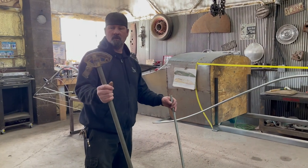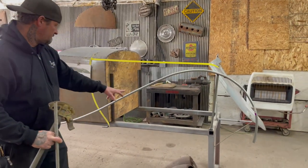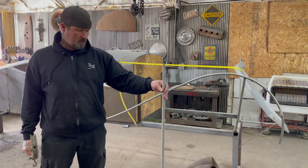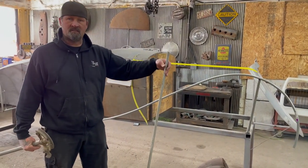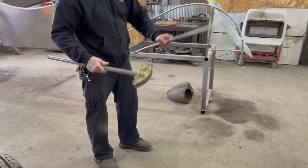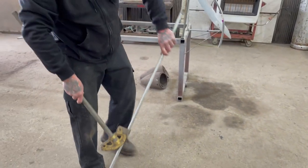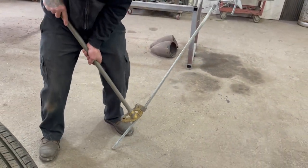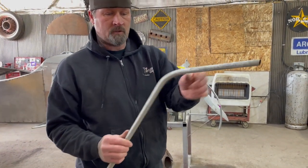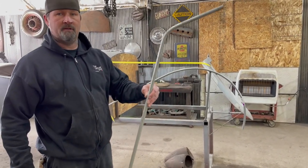Ace Hardware, Menards, Home Depot — they sell these electrical conduit benders. That's how I get these shapes. You get the 10-foot sections of half-inch metal conduit for electrical, and it's like $3 to $4 a stick. All you do is use that electrical conduit bender — you drop it in like this. You can do a bend without tweaking the metal so you can get a nice bend. If not, it's a pain trying to do this — you'd have to fill it with sand, but that's a whole other video.